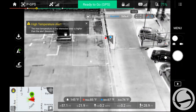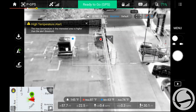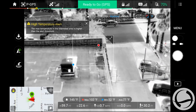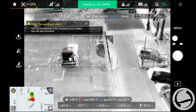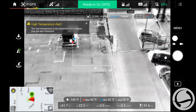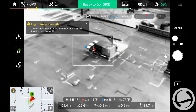Right, see that? And now you can really see it. There's actually another one right there. You can see it's kind of pulling down towards that side. There's actually a drain there. And that's common near the drains, because that puts a hole in the roof where the water is supposed to drain through a funnel. That could definitely be a problem spot right here along this wall.